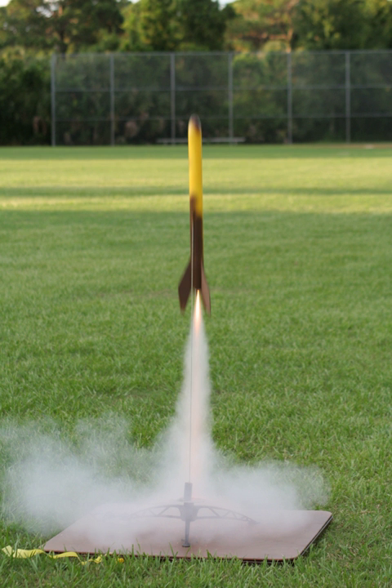On April 21, 2019, USCRPL launched Traveller IV-1, an 8-inch diameter vehicle from Spaceport America. All subsystems were reported as successful and the vehicle was fully recovered. On May 22, 2019, a white paper was published calculating an apogee altitude of 339,800 ft ±16,500 ft, giving a 90% confidence that it passed the Kármán line. This makes it the highest performing student-designed and student-manufactured rocket in the world, and the first to reach the internationally accepted definition of space. However, the rocket experienced a loss of GPS data from approximately 13 seconds to 278 seconds of flight, therefore missing apogee.